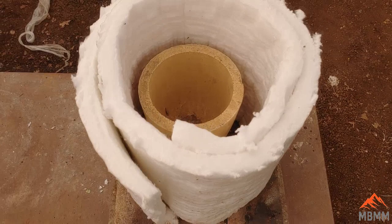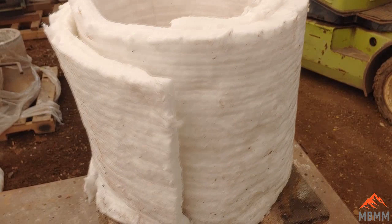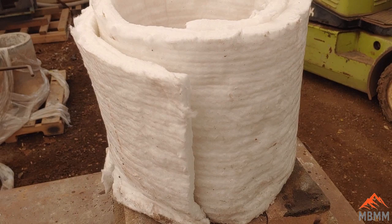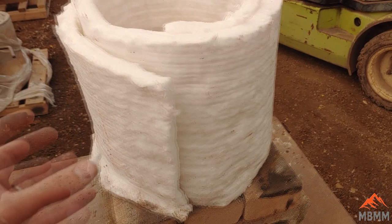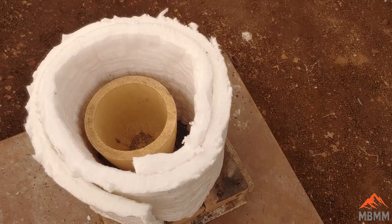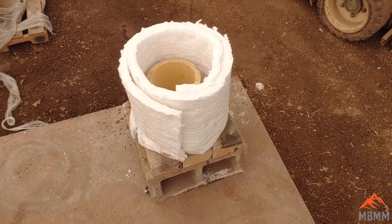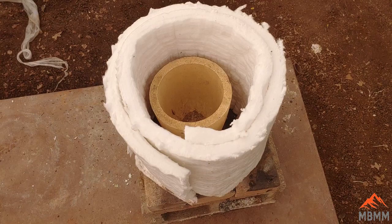Here's the half I cut — I've got my crucible in there and I've got plenty of height, so I could actually fit a little bigger crucible. Now I've got it double wrapped. Instead of water glass this time, I'm just going to band it together with some tie wire since I'm in a bit of a hurry. For this furnace I'm going to leave the wrap in place and reach in to grab the crucible out with tongs. In bigger furnaces, the less handling you have on the kaowool, the longer it lasts.